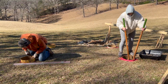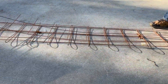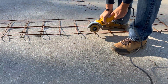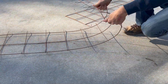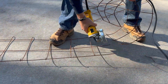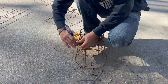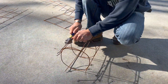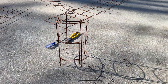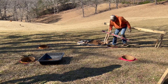While we're digging, I'll quickly describe what I ended up doing. I had some leftover rebar mesh, so I just cut it up and rolled it into a shape that would fit into the sonotubes, then tied it together with some rebar ties. I feel like this is completely sufficient for this kind of project — didn't need to spend extra money on big rebar. There's an example of how I set that in there.